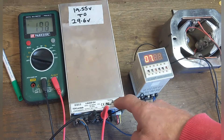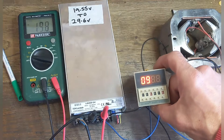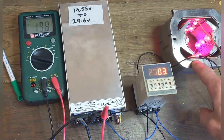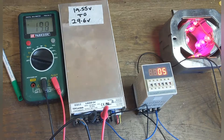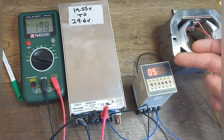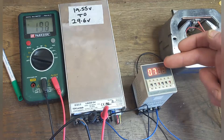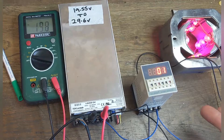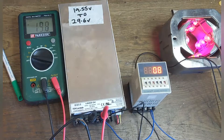The power supply is on constantly - it's just the relay then applying whatever load is attached to it, which in this case is a light. I've attached a dump load to it and that works. This brings us to the reason I wanted to start playing with these - I wanted to get it working off my wind turbine, some kind of automatic system where this comes on every five seconds and off for ten seconds, or you can set it up any way you like.